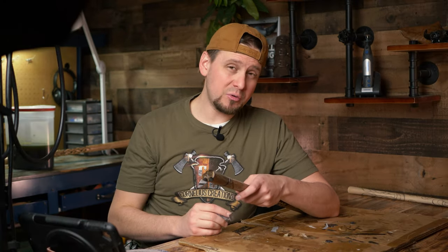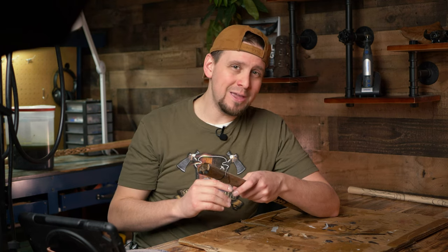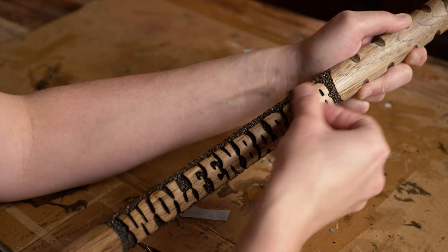I'm using a very fine sandpaper grit. You do not want to go too low — I would recommend the lowest you go is 220. I'm using 325 right now. Just make sure you are pretty high in your grit, because if it's too low you're going to dig deep into the urethane. You don't want that — you just want a lot of fine scratches over the entire piece.